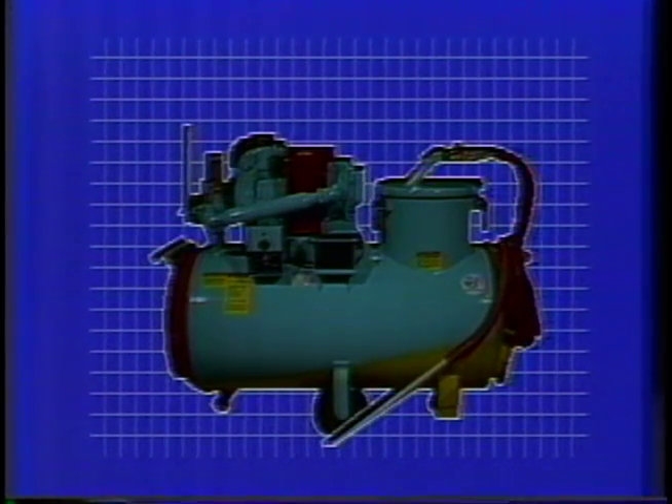What is a yellow-bellied sump sucker? It is basically a large, powerful, liquid-solid vacuum cleaner designed to remove from the machine sump anything that will fit up its two-inch suction hose. Grinding swarf, milling chips, and properly broken turning chips will all come out of the machine sump through the suction hose.